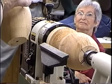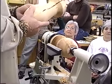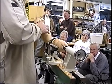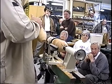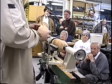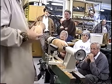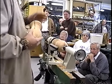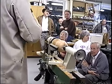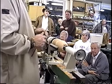But even though it has a crack in it, one of the things that I like to do is carve or turn things that are less than perfect. You can fill that with a 2-part epoxy, and it'll give it strength. And if the epoxy gets down in the crack well enough, then it's just like a regular piece of wood. My wife taught me that. You can lay the epoxy in, it's not too hard. It'll turn just like the wood.